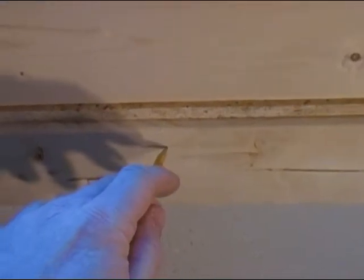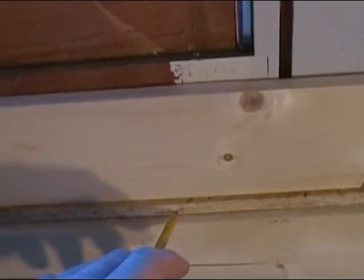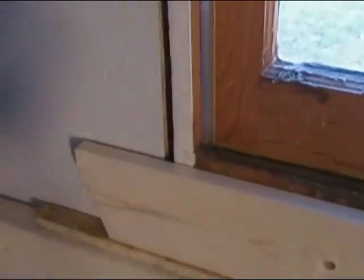Okay. Now underneath here, we're actually building some workbenches, and I haven't put the plywood on. We just got the framing up for it. So notice I took a piece of scrap OSB and slid underneath here just to give me my right distance. So I'm gonna go ahead and nail this in place, and then we'll be ready to do them uprights.